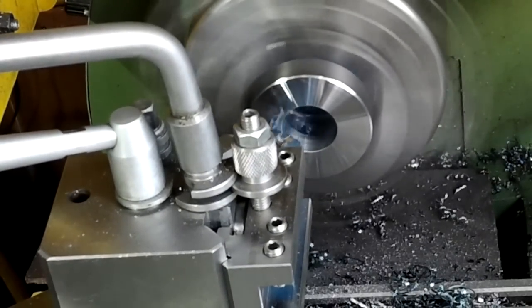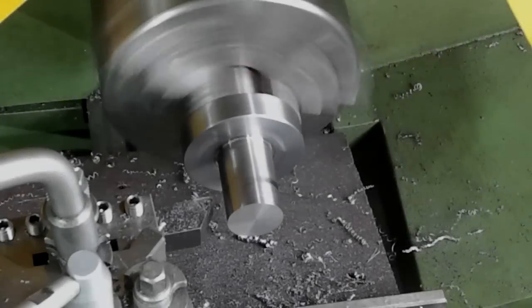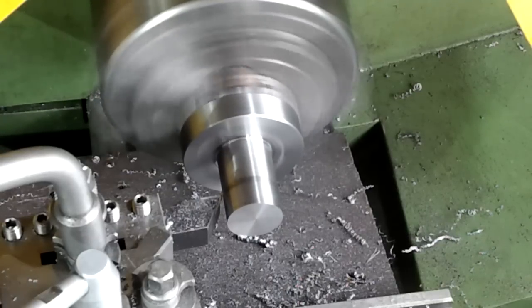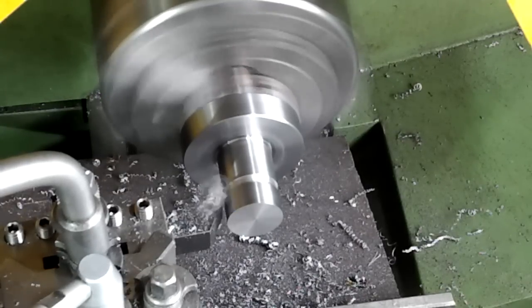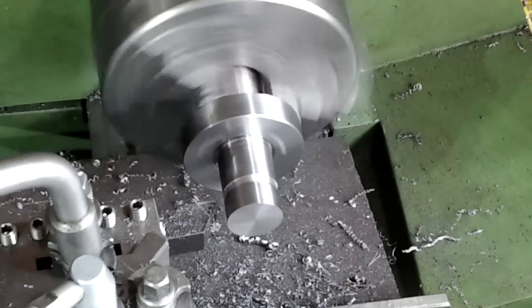After making the collar, then drilling it and welding it to the shaft, I put it back into the lathe and tidied everything up by machining 0.4 of a mil off down to 25mm. I'm going to put a thread on the end of this using my thread cutter, and because I'm using a 2mm thread I need to put a good thread relief on the back so as not to break the tip.